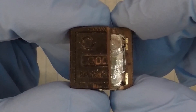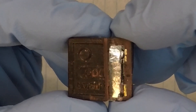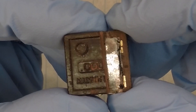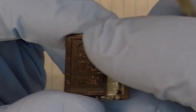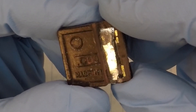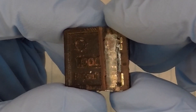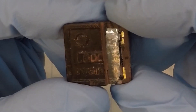If you go back and reference some great material from Joseph J. Carr, he mentions two different types of mica capacitors that were built in the day. These are sealed devices, and it appears for whatever reason the failed 1,000 picofarad capacitor is compromised.